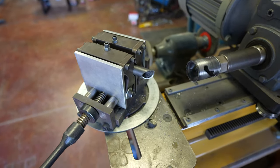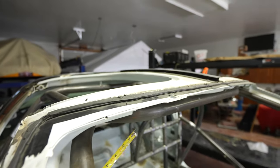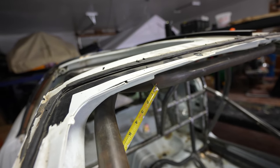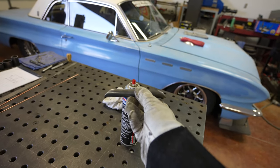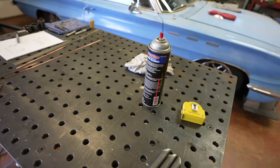There it is, one down. After talking to my dad on the gusset, we decided to go about six inches because four gets pretty small — once you get up in there, a four-inch gusset would be tucked way up in there. There's also that gray area of whether it's four inches on the long side or four inches on the short side. A little bit longer is not going to hurt, and on a six-inch gusset it'll be easier to weld and get to. So there you go — three six-inch gussets, coped to 45 degrees. You can see they already get quite a bit shorter just with the cope, so four inches would be really, really small.